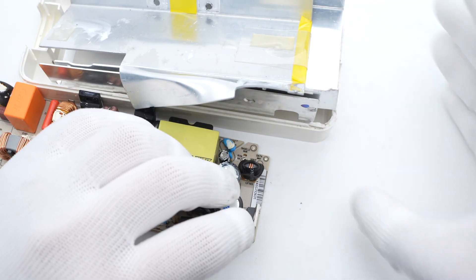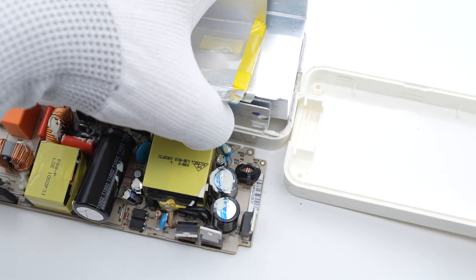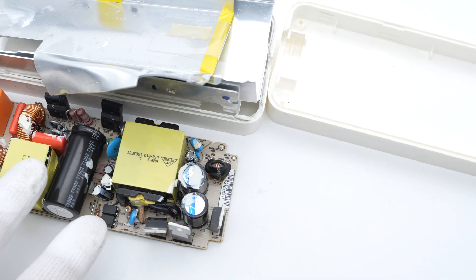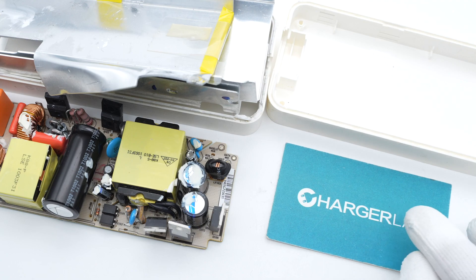That's all the components of this Apple power adapter released nearly 20 years ago. It's much like the big and heavy power adapters seen on some Windows gaming laptops. Now, the power supply has been integrated into the Mac Mini. After taking it apart, we found that the internal heat dissipation and protection measures are similar to current Apple power adapters, making this charger high quality — but the internal module design is not very compact, and the topology is relatively outdated. Okay, that's all for today's video. Please like, leave your comments, and subscribe. See you in the next video!